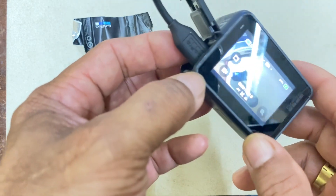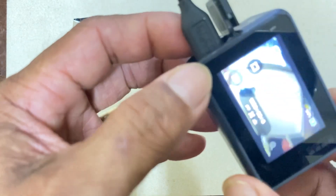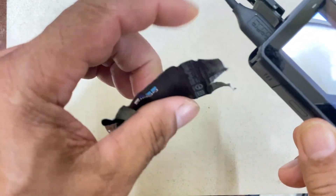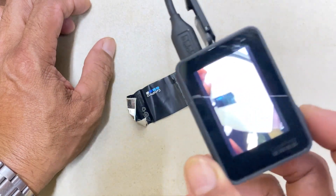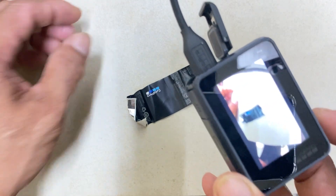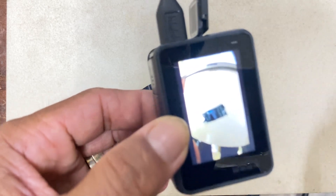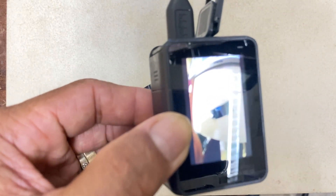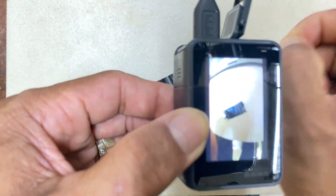I think this battery is already dead, but at least I've shown you that we can remove the gas from a bloated GoPro battery. The very problem was you cannot insert the battery inside the GoPro because it's bloated, but if you release the gas — especially for those GoPro batteries that are still working but just bloated — you can do this trick. Do this safely by using non-conductive material. Do not use metal because it will cause a short circuit if you poke the battery and it makes contact. The purpose is just to poke a tiny hole on the wrapper of the battery so you can release the gas. Do not poke the inner part of the battery.